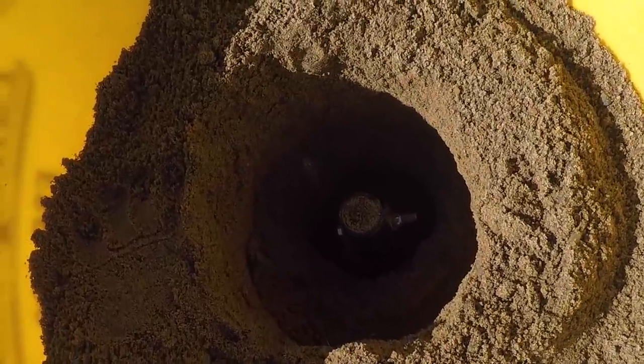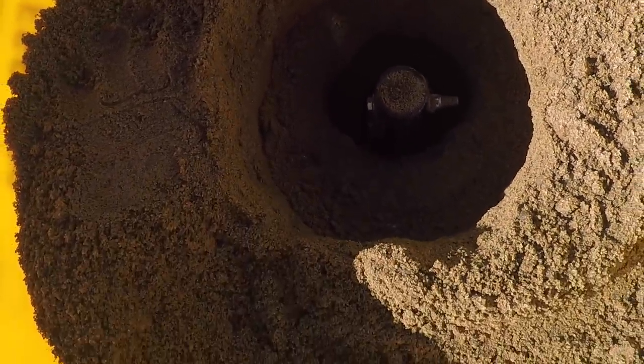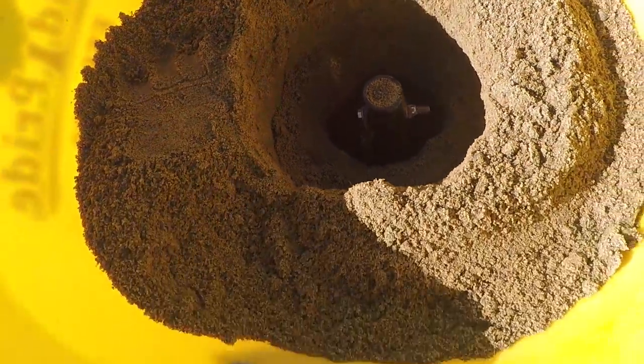First of all, I thought that was a brilliant idea, using that pipe and molding it in and then putting the chain at the top, because I thought that would drop everything down. But then not so much. That's what I assumed. I thought it would draw the sand into the center and it would drop down. Right. But it built up halfway down again. Mm-hmm. So hence that second piece of chain. Yeah. Now we've got sort of a Coke bottle shape in there, but it's getting the sand down strong. Yeah, well, it's interesting to see the bridging, I guess you call it, the way it bridges around those chains, but it's still enough that it's knocking it down.